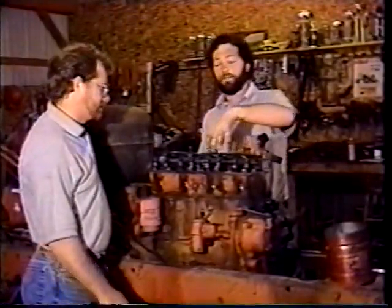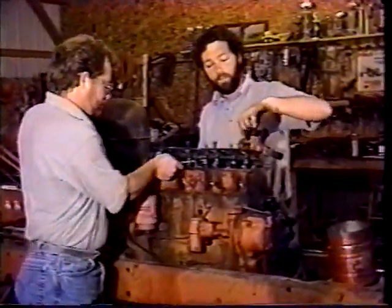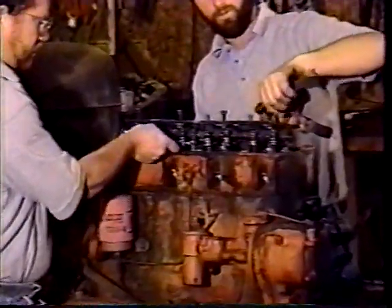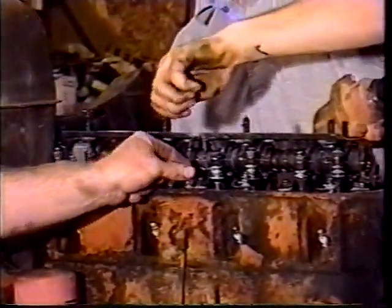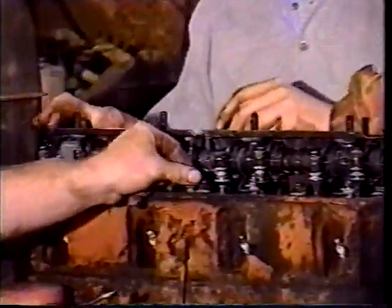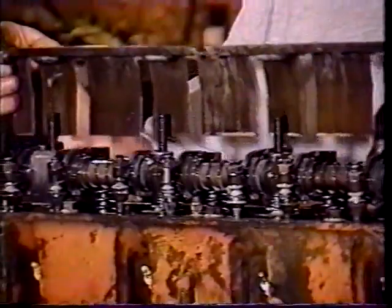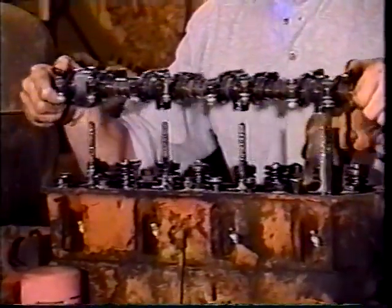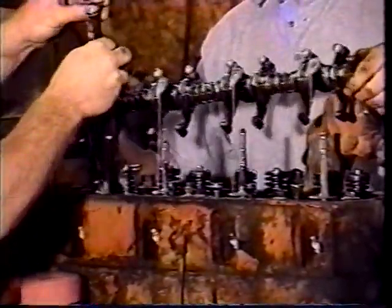We've got the tappet cover off the top of the engine. Now we got to take the rocker assembly and the push rods and everything out. There's four bolts that hold it down, and they're really long, so you got a lot of threads to go down. There's also an oil tube here. You need to get this little connection loose so you get this oil tube loose. Pull that off. Little shield comes off first. You should be able to lift the rocker straight off. Hopefully your oil won't look as bad as it does in this one.